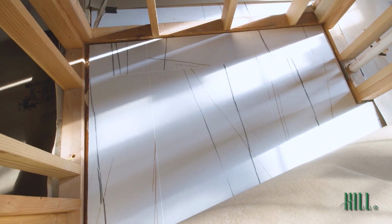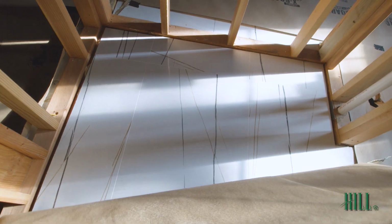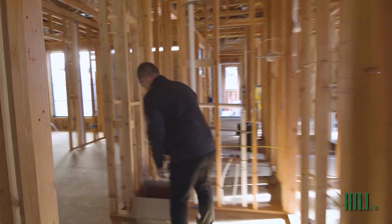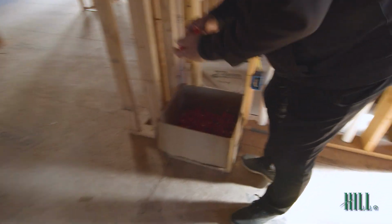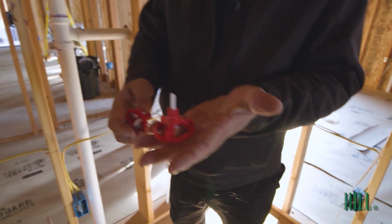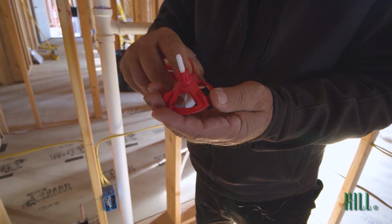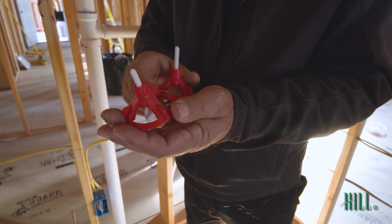Big dogs in here. You'll see this again when we get the paper off near the end, but this is what's in the whole floor system. And I'll show you what the little leveling brackets are that we use to put this stuff in. Little spacer systems go underneath. You can twist this up so the four corners of the tile will all come together nice and evenly.